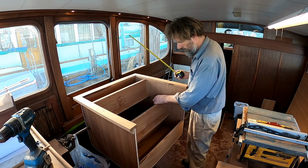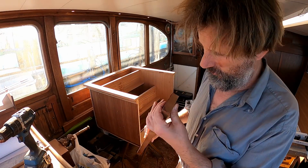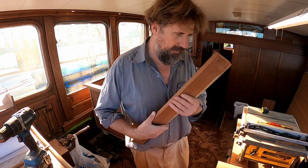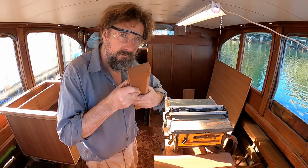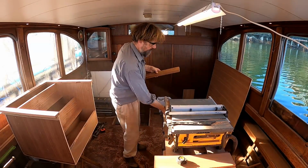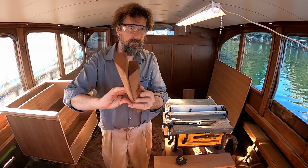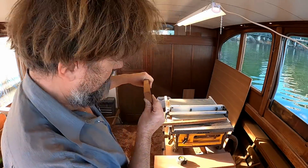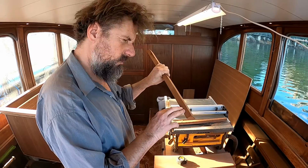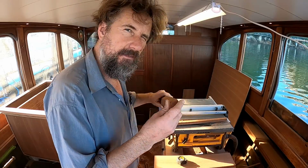All it means now is I need wider support blocks, and I think I might have some. Okay. Haha! Some 1-inch sapele mahogany from my stash. I'm going to say it was not easy to get to. All right, let me turn this into something we can do here. So what I'll do, I have 2 of these, and I'll set these up so they sit in and the tread sits on them. The extra inch gives me a full 3/8, almost 1/4 to 3/8 for the tread to sit on. And the slice pieces are a strong 3/8 to 7/16.